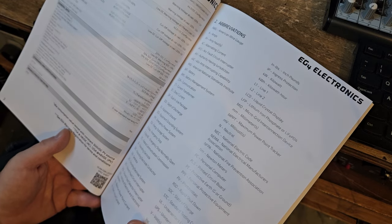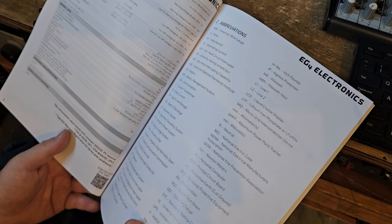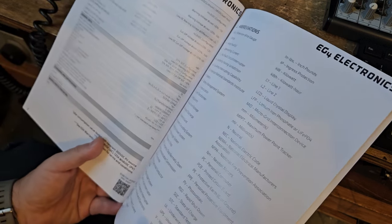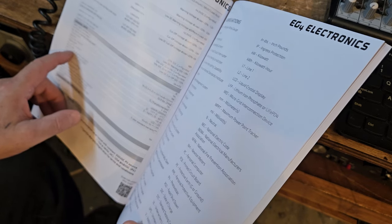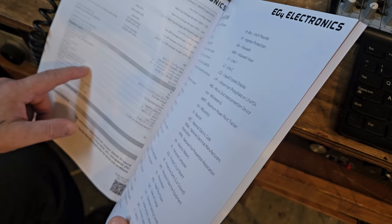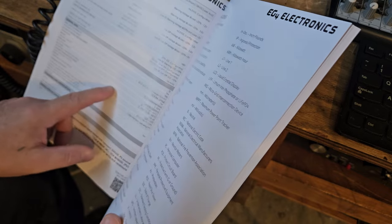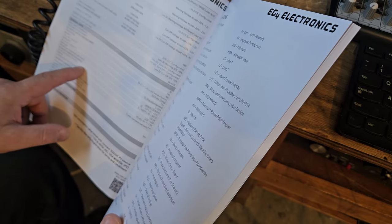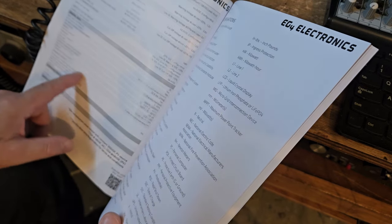General data, maximum units in parallel, 16, integrated disconnect, yes, DC switch rated for each MPPT, weight, 52.9 pounds. Transformerless. Relative humidity, altitude. Operating temperature range, 32 to 113 Fahrenheit. Storage temperature, 5 to 140 degrees Fahrenheit. Noise emissions, less than 58 dB. Communication interface, RS-485, Wi-Fi, and CAN bus.